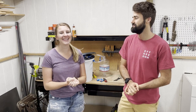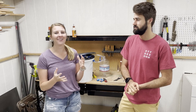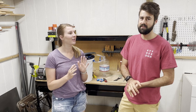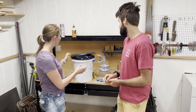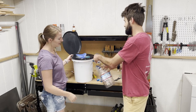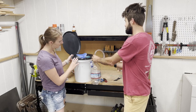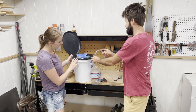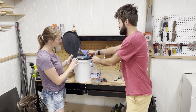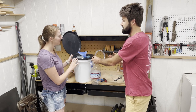Okay, at the end of our last time working on the bucket toilet, we figured out that there are some problems with it that could be improved. So some very big pee problems. Most noticeably, the fittings we had required too much tubing to prevent kinking, and then we had sections of tubing above the input, so we had flow issues.